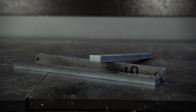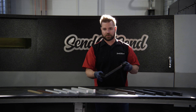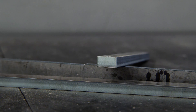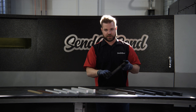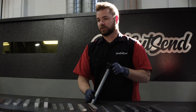What you're going to see on hot roll in particular is the mill scale. Mill scale is part of the hot rolling process — it's an oxide that's left over when they form the material. If you've ever welded this stuff, you know you've got to grind that off to get a good weld. Same is true with our material, so keep that in mind. If it's going to be painted or welded, you're going to need to remove that mill scale.